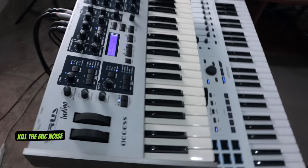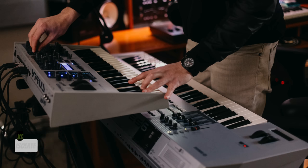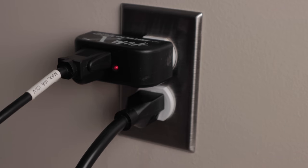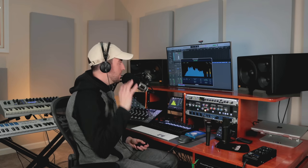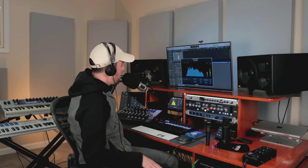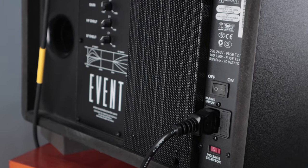There's going to be some equipment in your studio that just produces a hum based on the power supply or transformer internally. I have a keyboard that has always produced a bit of a hum, so I use what's called a Hum X — I showed this in my previous video. You can plug that keyboard directly into the Hum X and the hum goes away immediately. This does not work in every situation. For instance, I had a left studio monitor producing a noticeable hum in my signal chain. Hooking it into the Hum X did not fix it, so I found a local audio repair specialist. He actually had to modify the physical speaker itself — moving the mid-frequency driver away from the crossover, because that was producing some hum and interference. I paid about 40 to 50 bucks for that modification, and it makes a huge difference in terms of the quiet recording I can get right here at my computer.